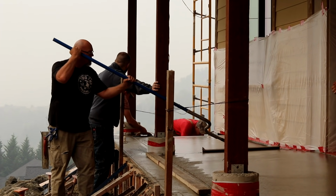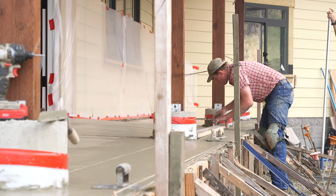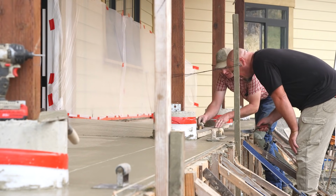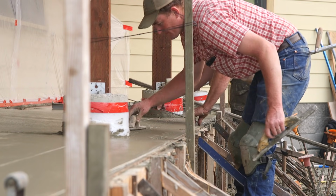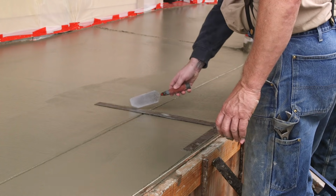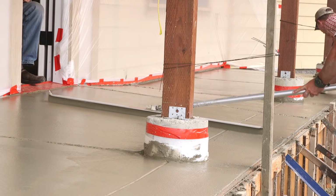Besides the crack control aspect, the grooves become a design feature in themselves to sort of break up the appearance and add interest. In fact, this is a big enough deal that I determined the locations of all these joints, along with Dustin, well before we even scheduled the pour date. This is one of those cases where form and function are equal priorities.